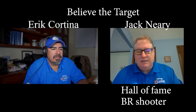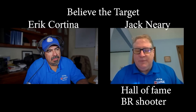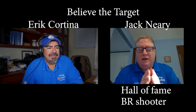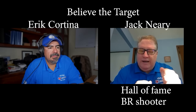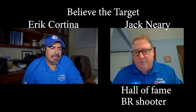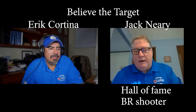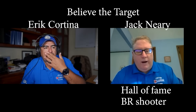But once I'm neck turning that case, you're going to have a certain feel for it. If I'm expanding the necks on all my cases and I've got cases that have been sitting there for a few hours before I've gotten to them, those latter cases that have been sitting there — the neck is expanding, coming back, contracting, springing back. Now when I'm trying to neck turn, I can feel the difference of increased friction. That is going to induce a lot more heat from the friction and will change your thickness of cut and cause more inconsistency than you really want. So only expand right before you neck turn that case — I do not expand until I'm ready to pick up that piece of brass and neck turn it.